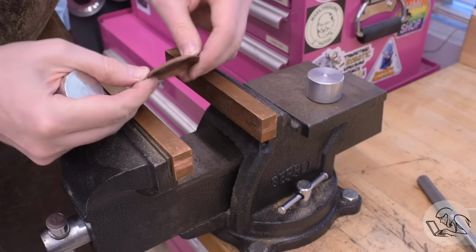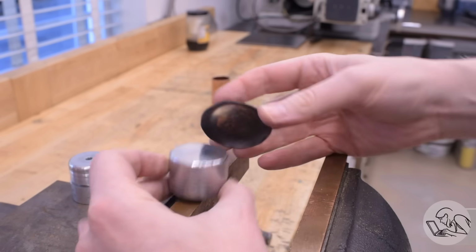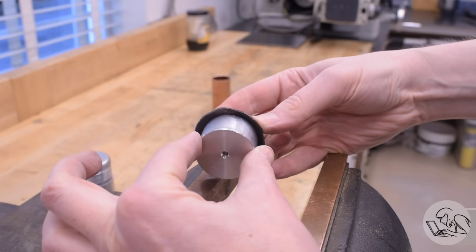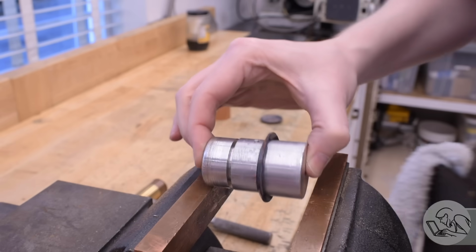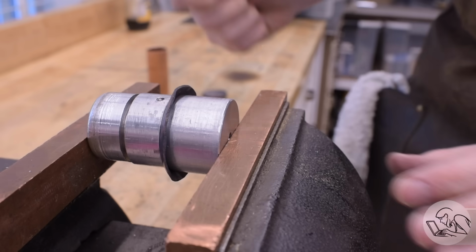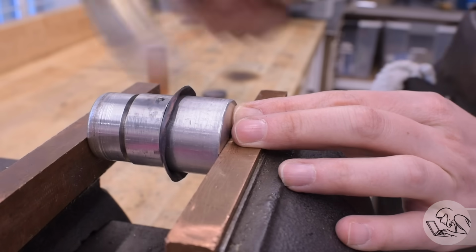After the first annealing though, it's got that shape to it that is sufficient to align it. So you don't need any kind of alignment pins or through bolts or anything. It will self-align once you've got that first little bit of shape in there. Some more complex pieces, it is helpful to have alignment mechanisms of some sort, but for simple round pieces like this, you really don't need them.